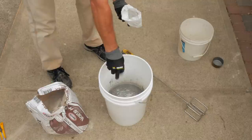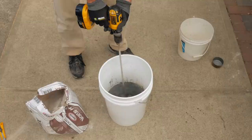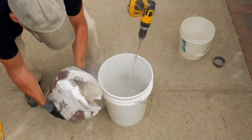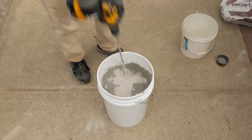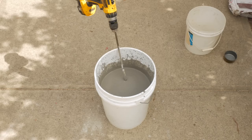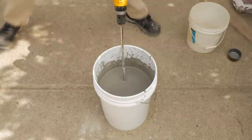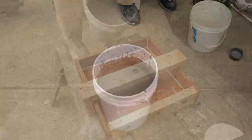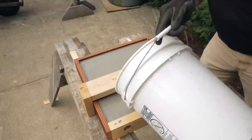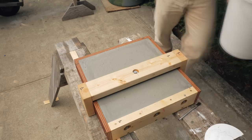I have a full blog post for this project at manabouttools.com that lists details for the concrete mix I used and all the tools and hardware. The CSA mortar mix has a light beige color, but I wanted to make the legs gray, so I added black concrete dye to the mix — I was thinking it would blend better if I added it to the water first. I've been asked a lot about color additives for concrete, so I added some for these castings and will try other colors in the future. I used a wooden dowel to stir the mix to check for any clumps, then poured into the form filling it right to the top. I really like this CSA mortar mix — it's really easy to mix, pours like water, sets up fast, and requires little or no troweling.